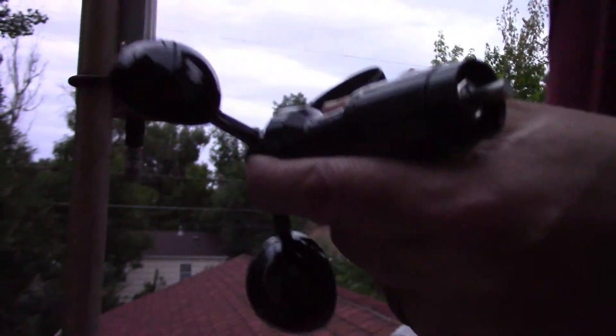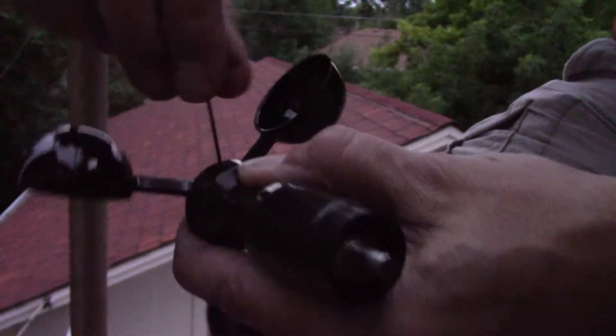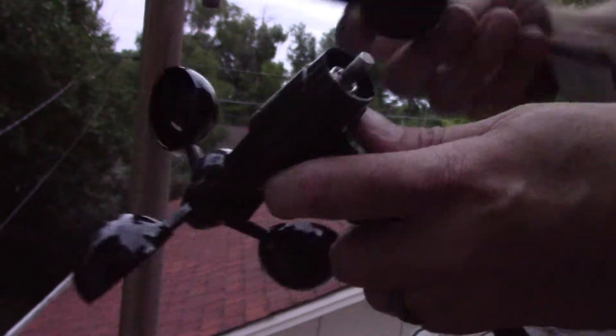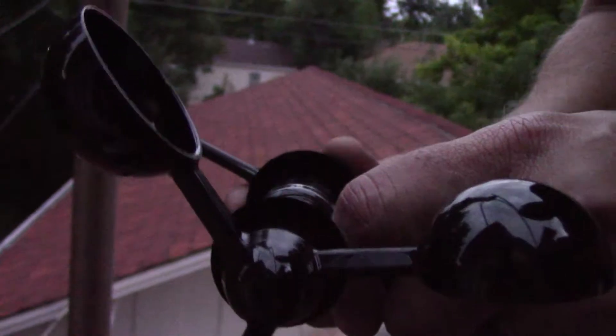We'll get the old one out of the way. The new one goes up in there, and with our handy dandy allen wrench that we set aside — made sure we didn't lose it — we use that to tighten it up. It's in place now and spins freely. Same thing with this one: it has a little set screw, and there's a flat on the shaft. Looks like they put the flat on the opposite side of the screw. Put that in place, tighten down the set screw. Here in Wyoming the wind blows heavy duty, so make sure things are tight — both guys spin, we're good to go.